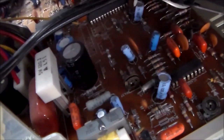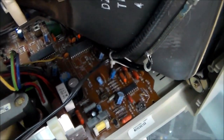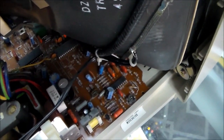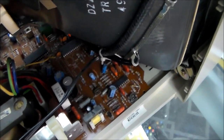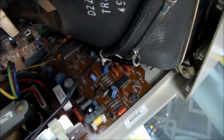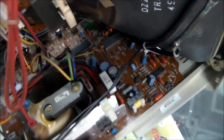So basically what's probably going on is that the capacitors have dried out. If you look at that black cap in particular, see how the top of it's domed up just a little bit? It shouldn't really be like that. And since they're having you check at that cap, that's probably a fairly important one — and that cap is messed up, so there's probably a bunch more. These things are 32 years old now. The way to fix it is to go through and replace all of those capacitors. So I'm going to disconnect this board, take it out of the frame, and go replace the caps on it.